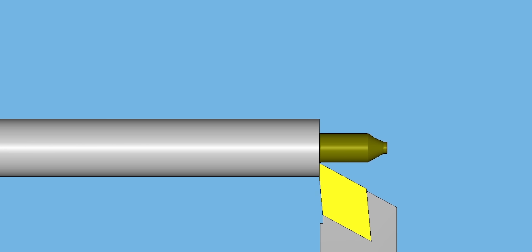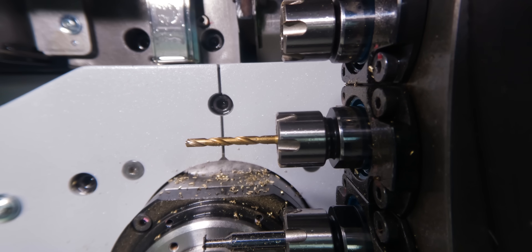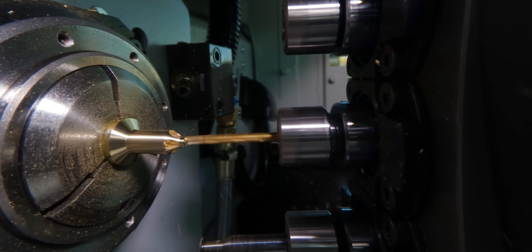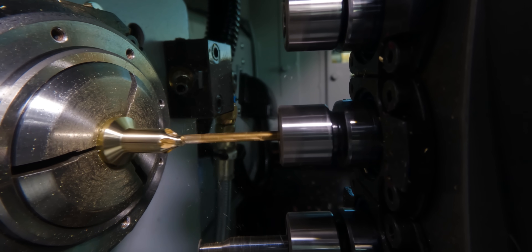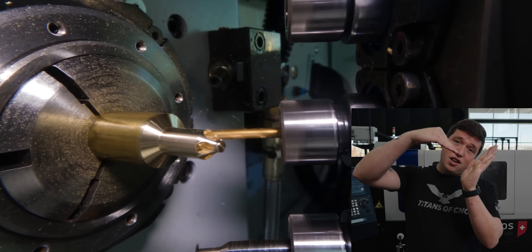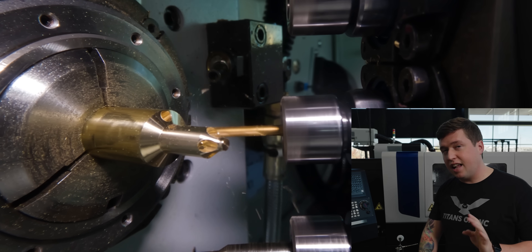On the finished part, you don't even see that I did this. And of course, after you do that, you're going to roll a burr into your four holes. So you just come in again with the B-axis and you pop out those burrs. It's actually super simple. And you'll see as the part progresses, I do this again on the second set of angled holes, just a different angle — I do 60 and I do 30 — so the drill is perpendicular to the surface it's drilling into. Makes life a lot easier.